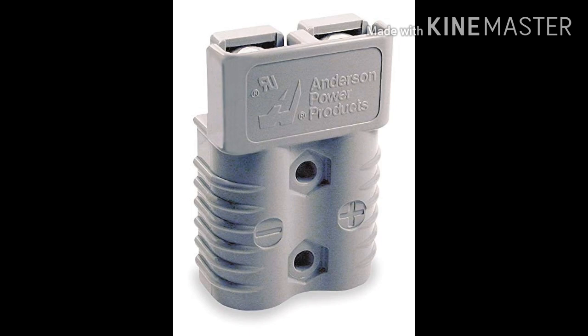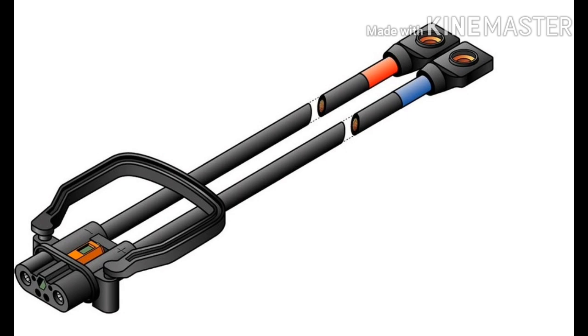The flat style Euro DIN battery connector harness includes the battery connector, cable, and takeoffs from the positive and negative terminals. Many batteries used on modern forklifts are now supplied with a cable harness that is molded as one piece and includes the connector. These are called molded REMA connectors, or MRC for short.